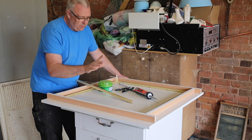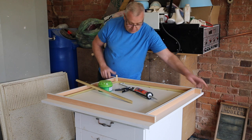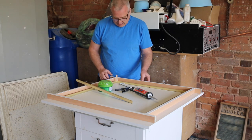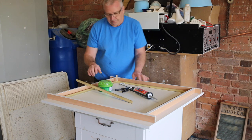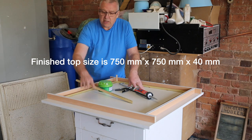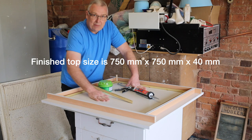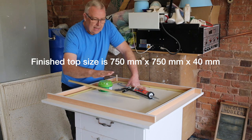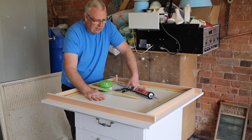So, the material you need to make a mould — whatever you make the positive mould from is what gets formed into the finished top, so you need something to actually make the mould in. Ideally you want a piece of dead smooth melamine-faced chipboard, or MFC as it can be called. I haven't got a piece of dead smooth; I've got a piece with a slight texture on, so we'll see how that goes.